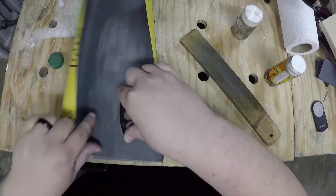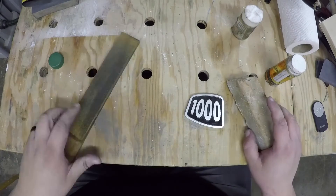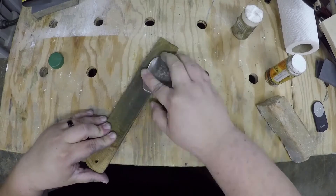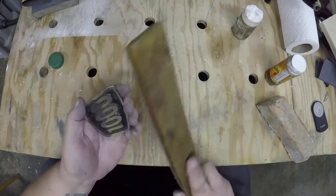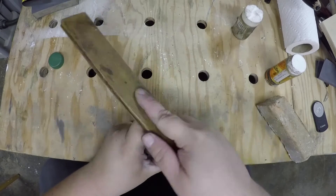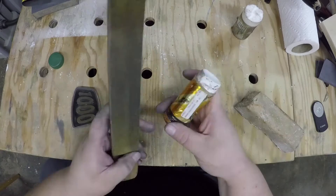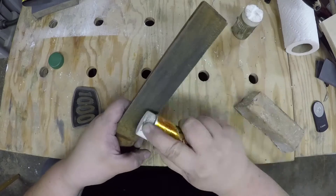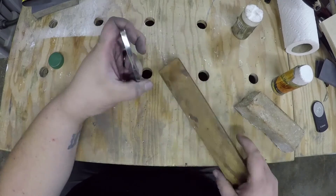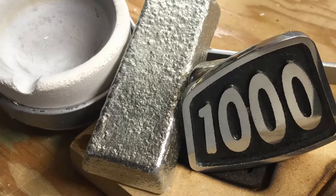That paint is the Rust-Oleum 2X coverage — on this project and the previous one I used it for something similar, and I don't know if I really like it, so I'm going to try some new paints. Here I'm using a leather strop — when I was younger my jewelry teacher made this for me and we didn't really have a name for it; once I got into woodworking I learned it was called a strop. I've had it for about 15 years since he made it back in high school. You apply polishing compound: the first is called tripoli, which is a rougher abrasive, and then there's jeweler's rouge called Fabuluster, which is a finer abrasive. You can also use this on a Dremel or flex shaft with a polishing wheel, or on a large buffer, but I just felt like doing it by hand.